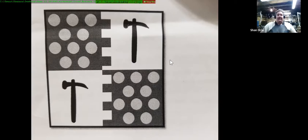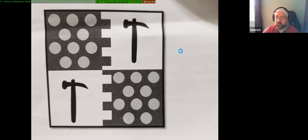You want to keep the die annealed while you're applying punches and engravers to it, otherwise you're going to have a hell of a time. Any hardening is at the far end of the process, at the finishing of the die before you start striking.